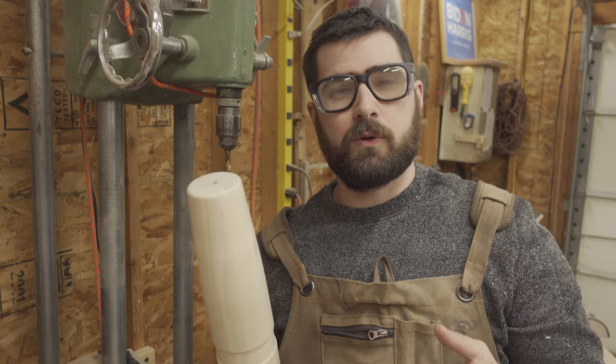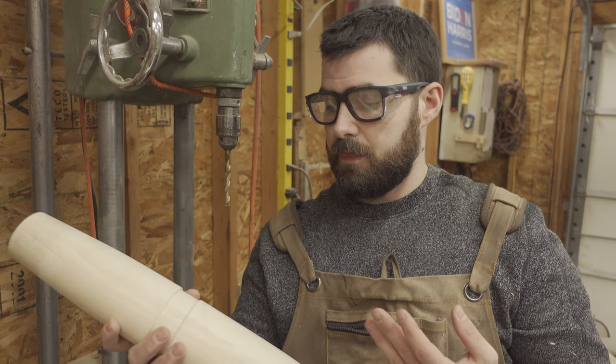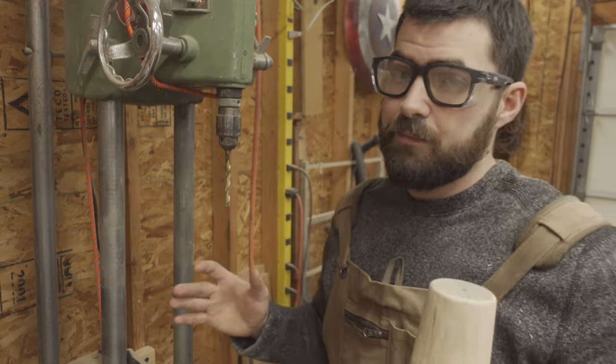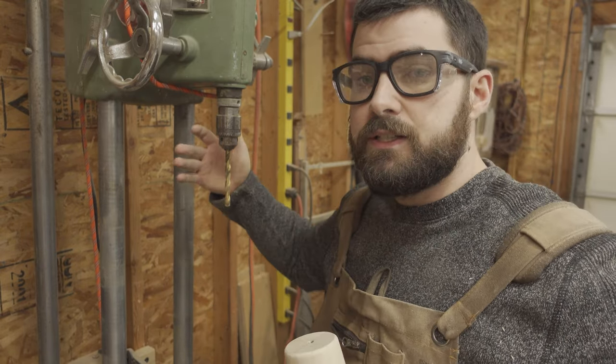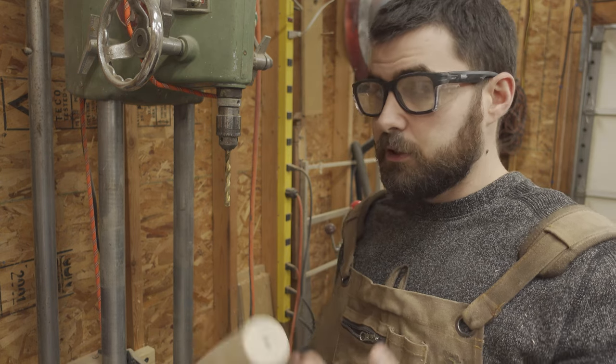Now that the pin is complete, we have the not very straightforward task of drilling a hole all the way through this pin. This pin is about 16 inches long, so it's not so much that it's going to be hard to drill a hole in the center, since center is already marked for us on both ends from the lathe. It's the length of a drill bit that's going to be the main limiting factor and the capacity of a drill press. So I have a three-eighths inch spade bit that is long enough to reach through the entire pin, but we still have capacity issues on my drill press. I want to make sure that the hole lines up on both sides so I end up with one straight hole through the whole pin. This is pretty much the main reason I keep this Shopsmith around — it gives me an incredibly deep drill press bed, so I should be able to get the holes nice and started and possibly drill all the way through this thing.